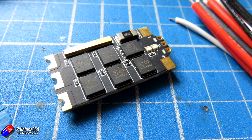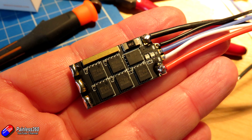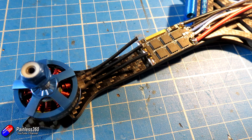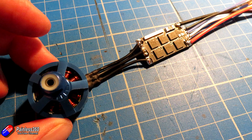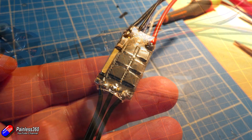To put the arms together I used the standard approach: first I tinned the speed controller for all the connections I was going to use, then soldered on the power wires and signal wires. On these ESCs there's not only the PWM signal and ground wires but also a telemetry connection to the flight controller. I took my time using a good soldering iron and decent solder, then covered each ESC in thin heat shrink to protect it while still allowing heat to dissipate on the arms.